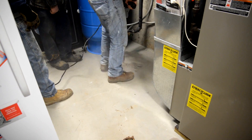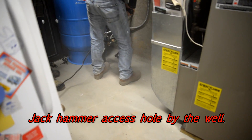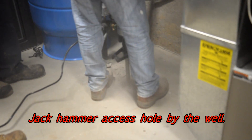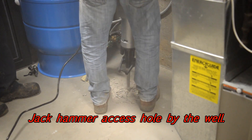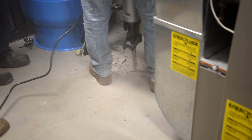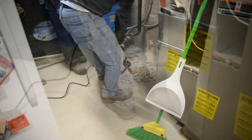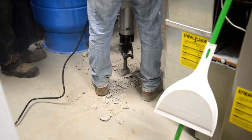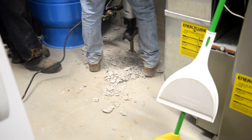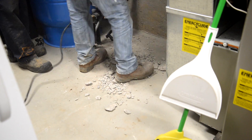Meanwhile another crew got inside the farmhouse down by where the well is. We have a large 80-gallon tank down there. We drilled through the concrete floor with a jackhammer to get access to the area where the water line would be coming through from the Ditch Witch. It took some effort punching through a reinforced rebar floor that's five and a half inches of concrete — but the jackhammer got through it and we punched about a foot-by-foot hole right next to the well line.